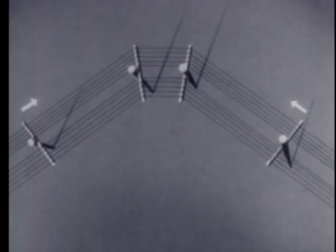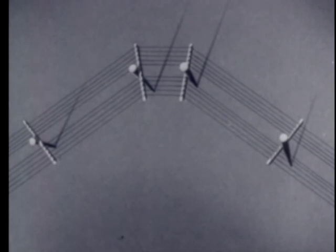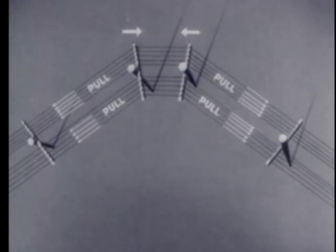The facing of the poles on either side of a two-pole corner is also toward the corner poles to take care of the pull along the line. The corner poles themselves face each other because the pull of the lines from the corner pole to the next pole is greater than the pull between the two corner poles.